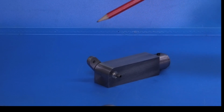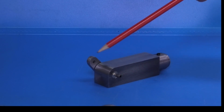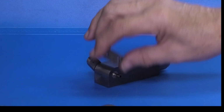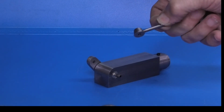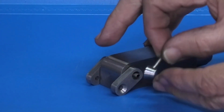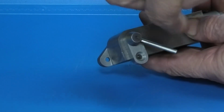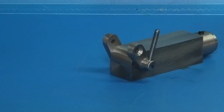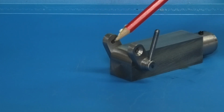So I've now made, finished off the brass bush to length and loctited the thread in. I've made this arm here and this one for the other side, and this locking nut with a little bar. The tommy bar is soldered into position. This now goes onto there with a locking nut on the front. These two will come up and the locking nut locks the arms in position. I've also rounded the tops off on the two arms, but the drawing shows them to have a square end.